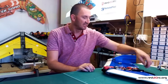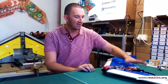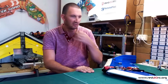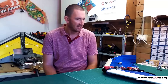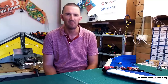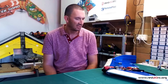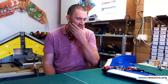I've also swapped back to the lighter 1100kV motor — slightly less power, but also a heck of a lot more efficient, so we should get some quite long flight times out of the 3300 3-cell. Am I happy with it? Yep, I think it's going to be a pretty good flyer. It could still be improved — I don't really like having to put lead in the front of wings to balance them, as it just takes up valuable flying weight and battery weight. But I think that's something you're always going to have to accept when you want to run the battery lengthways to keep things neat.